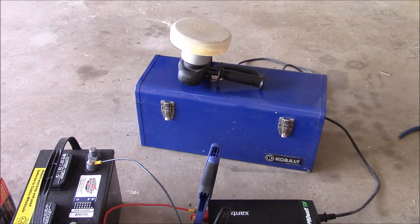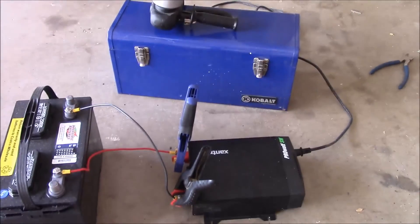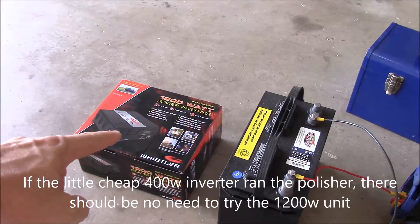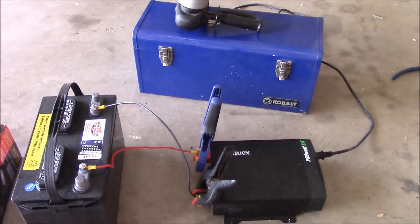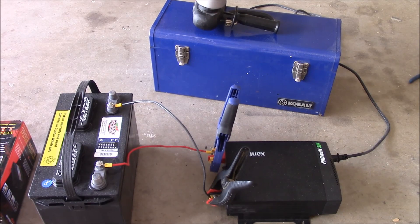Okay, well there you have it — I put it under a pretty heavy load, pushed down pretty hard. On the side of this inverter there's a voltmeter, and I could see it was taxing the battery more than the inverter. The battery was down to about 11.4 volts from 12.4 or 12.5, so it was pulling a pretty good amount of amps, but it just kept on going. I'm pretty impressed with this ProWatt — it does what it says it's going to do. I'll do an unboxing and test of the Whistler at another point and introduce it into the 'Will It Inverter' videos in the future. Hopefully this has been informational and enjoyable to watch. Thanks for watching, guys.